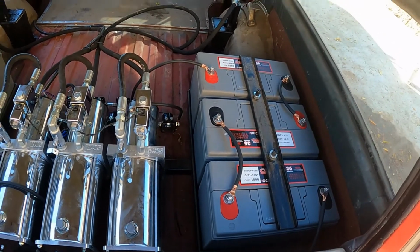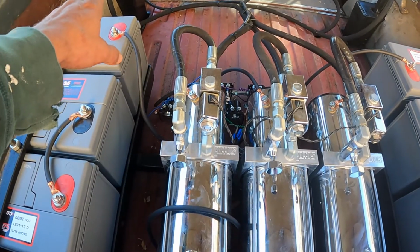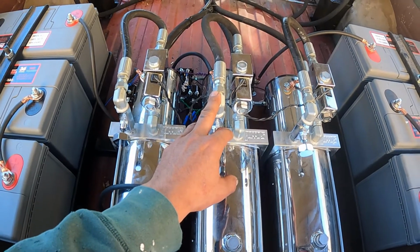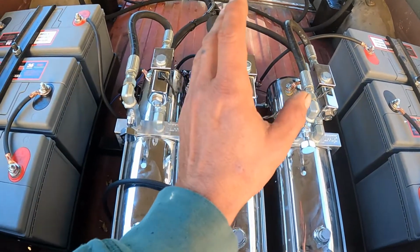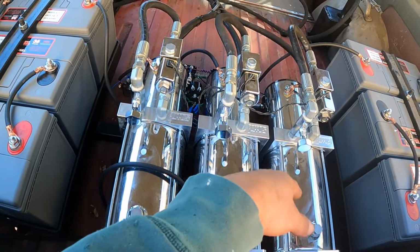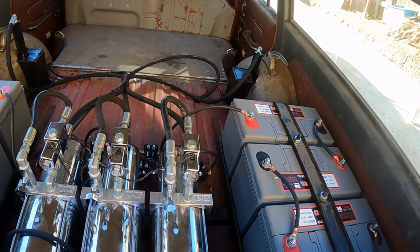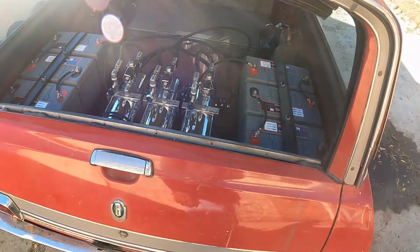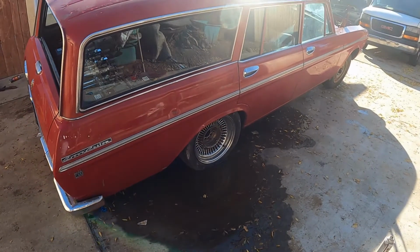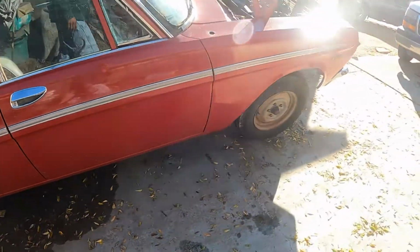So it's a pump to the left rear, a pump to the right rear, and then a single pump to the front. So that's a single dump for each one. So front is just independent up and down. They're both tied together, so it doesn't have any side to side in the front. But the back is able to get independently done, so he has that 3-wheel ability better. Looks really, really good. But he's coming to pick it up today.